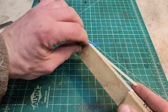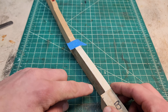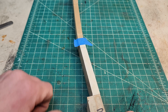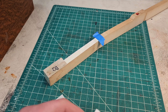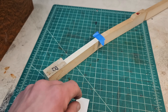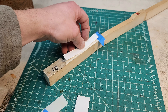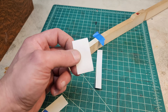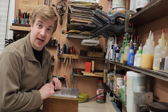This is actually tight from about here on. And given how clean the wood is underneath, I think what we'll do is work some glue underneath here and clamp it in place so we've got our registration. Now, when the time comes to glue on the head, we will use one of these ivory glue wafers — a piece of linen coated in a water and heat-activated adhesive, similar to hide glue. You can also get these in strips for the tail, but since I want to leave this exactly where it is and I don't have any of the liquid glue, we'll take some of the glue off of this wafer and use it under here. These are some of the tools I use when working with ivory key tops.